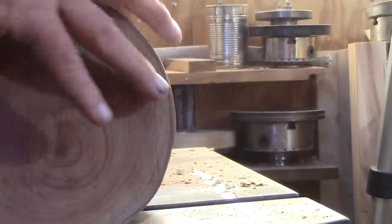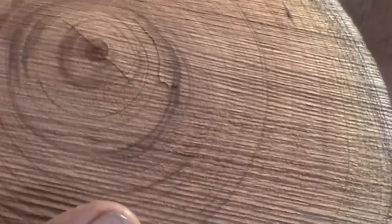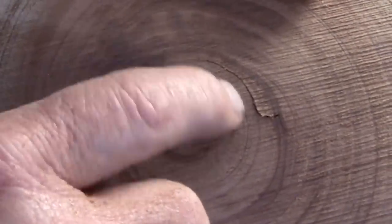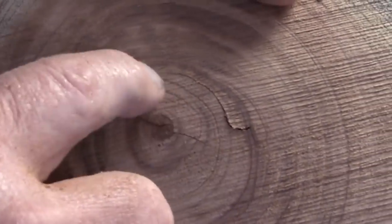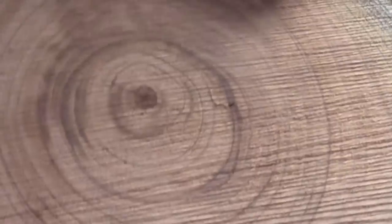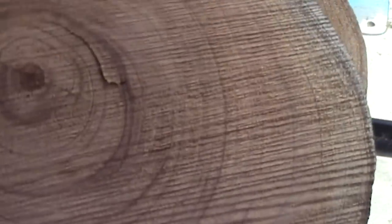This is my general approach to cutting anything. When I bend it you can see three of the little splits which I thought were there are on the other side — so that's going around the growth ring, which is likely to be a bit of a problem, because that means the wood's actually separated and that can be quite dangerous.